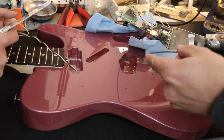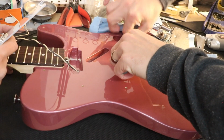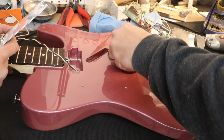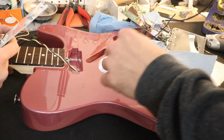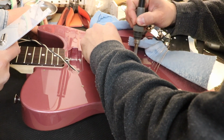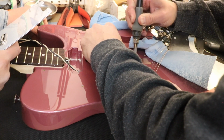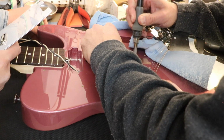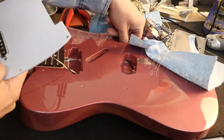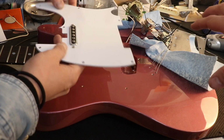And then I will go ahead and run the wire through here. So I like to use the same color. If we're going to ground it, I like to use a black wire. You don't have to. And then I'm going to try to make this a fairly quick route. I don't want a lot of extra wire hanging out in there. So I'm going to just make sure I've got some solder on it. Soldering to our existing joint down there, and then we should have conductivity all the way to the pot. And once we install that wire, then again we'll go back with the multimeter and test.